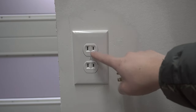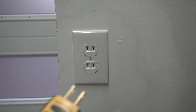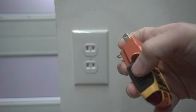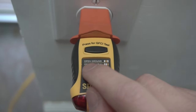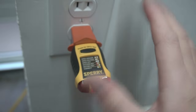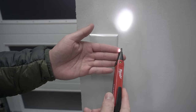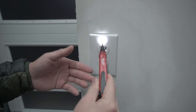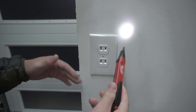Let's go check out what's going on with this receptacle. I have this receptacle tester by Sperry. Since this is a two-prong receptacle with no ground, we're going to have to use an adapter. Insert this and test out what's going on with this outlet. You can see that the middle light is on — if you look at the legend, open ground is indicated when the middle light is on. So this receptacle has no ground at all. Before touching this outlet, you want to test for voltage. Make sure that before you use this voltage detector, you actually test it on a live wire, because sometimes you might have a fault. You want to double-check that this tool is actually working. In this case, there is no power — we are safe.